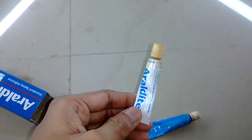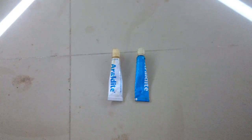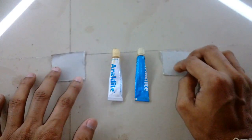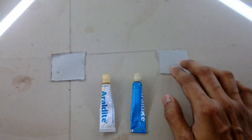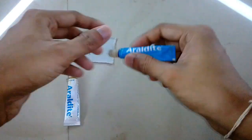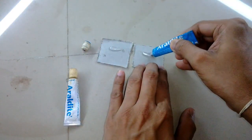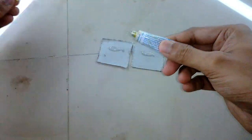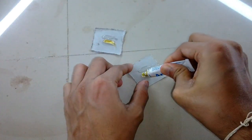This pack was never used because I was using a fast-curing epoxy from another brand, but sometimes I use this one as well. I'm going to make two samples, taking equal amounts from each tube on separate pieces of paper, then mix them. I'll keep one sample for curing at room temperature and use my SMD rework station heat gun on the other one. Here you can see I'm taking equal amounts of resin and hardener.